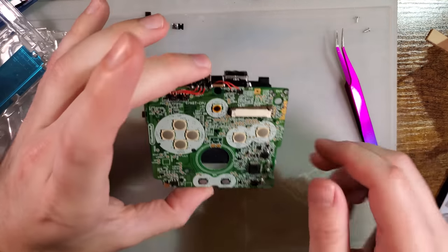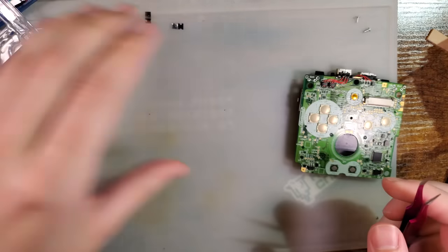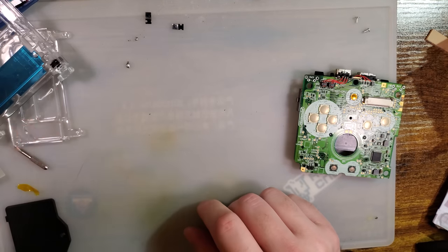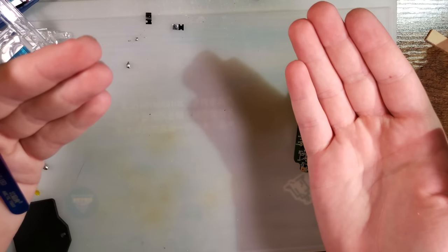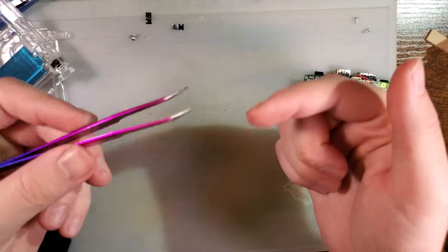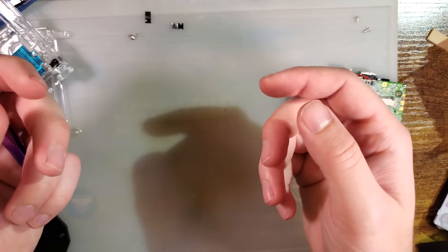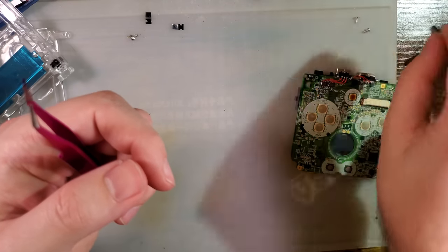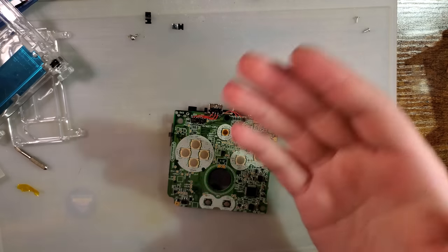Now, there's two reasons why not all multimeters will light up an LED in diode mode. I'll go more into detail on this in another video, but for the most part, it has to do with how the multimeter is built to test diodes, but also how the multimeter is actually powered. That big multimeter is powered by, I think, 4 AAAs, and the little one is powered by a little coin cell, one of these bad boys. So it just doesn't have the power. Anyway,